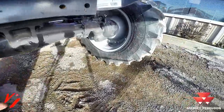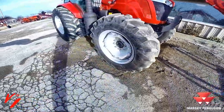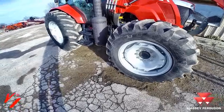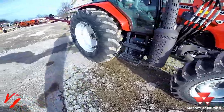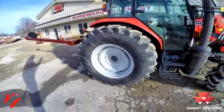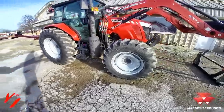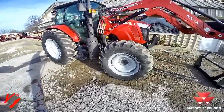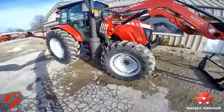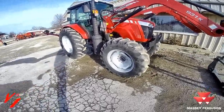You've got a big beefy front axle with Titan tires — 12.4-24s in the front and 18.4-30s in the back — that's going to bite that ground. The front wheel drive will help you get through the mud easier, and it actually helps you float on the mud in four wheel drive because the tractor gets up on top of the ground, instead of like a two wheel drive tractor that pushes through the mud.